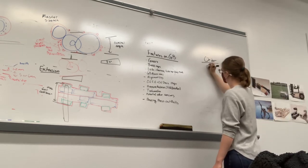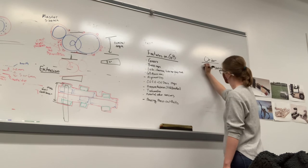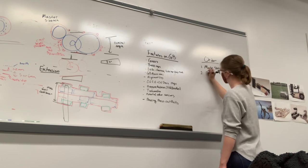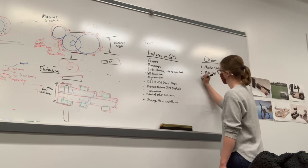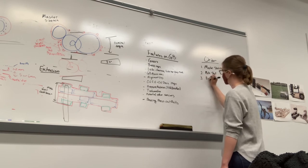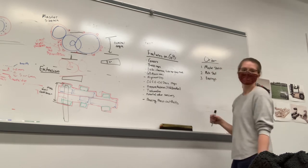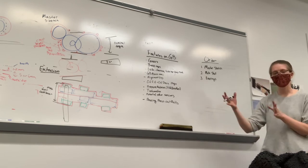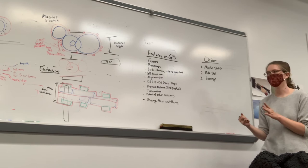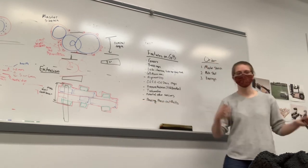General framework: you start with the master sketch stuff, extrude on either side, make the shell based on what you know is going to go where, then take care of the bearings. You add bearings, add thickness of walls, and then you put the parts in an assembly.